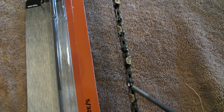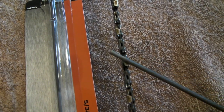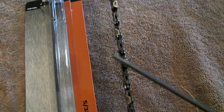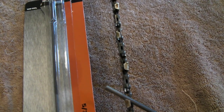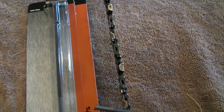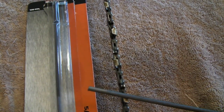All you have to do is take the file and put it on the side of the teeth. As you notice, you have teeth here and teeth here, and they go at a certain angle — it's pretty self-explanatory. It just follows the angle of the blade. You put it down in the slot and give it about three strokes — push it forward. The next tooth goes to the opposite side, so push it forward again and go to the next one.